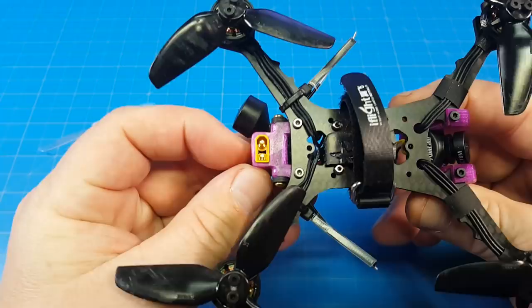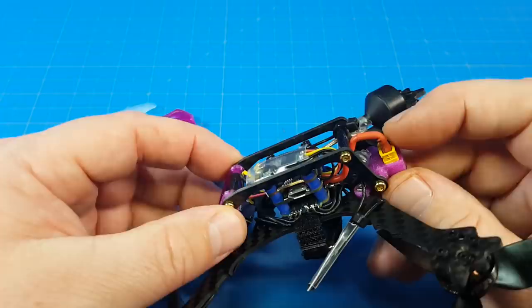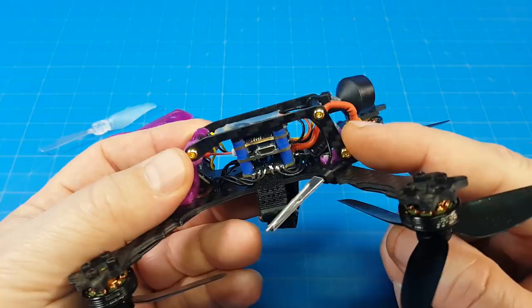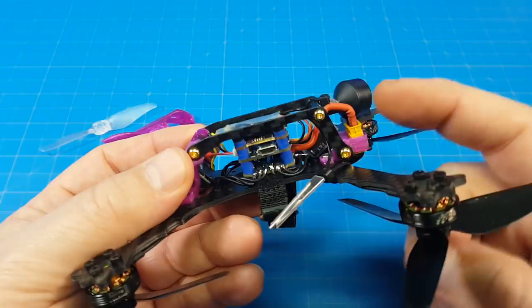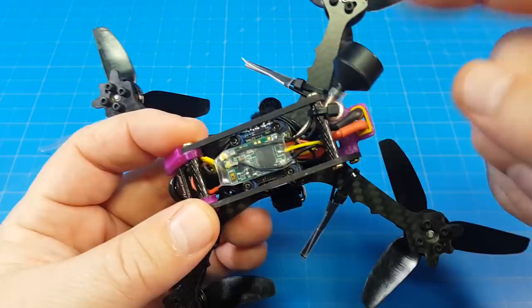The 3D print that holds our XT30 fits really nice. It does move around as you might expect when you have those batteries that really grip each other, but I really didn't have any troubles with it. The one thing I remember about the building was this area was something I really had to be aware of and work on, especially when I tried to squeeze the capacitor in there. I put the capacitor in from stock — you don't necessarily need it, but if you buy this flight stack it will come with it and I would suggest going ahead and putting it on there.